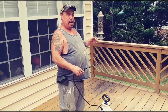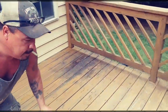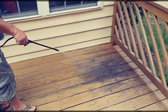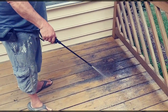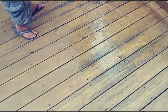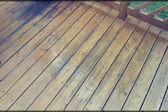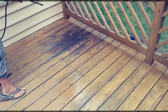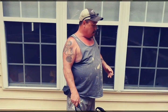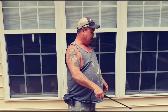I'm going to spray a little bit of pure bleach right here on this stain where there's been a bird feeder. It doesn't really matter because I'm going to come back and strip and stain this deck anyway. Basically you just put your bleach in your sprayer, come through and spray it all on here, and once it's all sprayed down real good you can take a water hose and wash it off. I'm going to go get a brush and scrub some of these hard spots because even pure bleach is not going to do much to those.